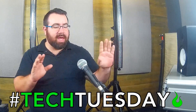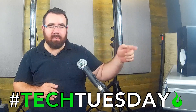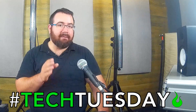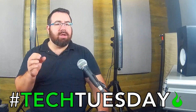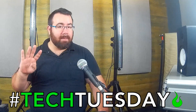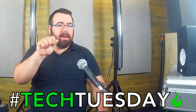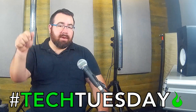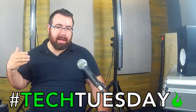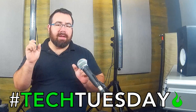I've got a standard Shure SM58, and I'm in very close proximity to a studio monitor that's pointing right at the back of the mic. What we're going to do is get the microphone as loud as it can go without feedback, then EQ the feedback frequencies out. I'll go to my channel EQ — four bands — slowly raise and sweep it to find the frequencies that cause feedback, then go to a 31-band EQ working in the background and take those frequencies out, surgically cutting out the problem frequencies.